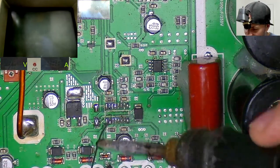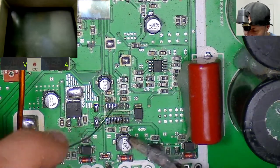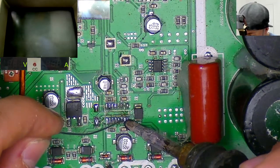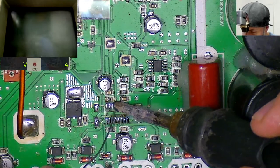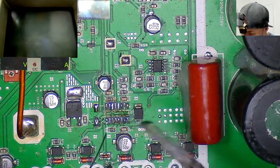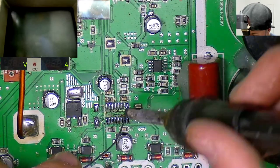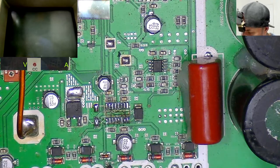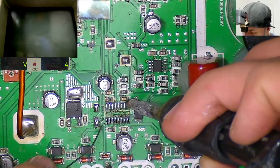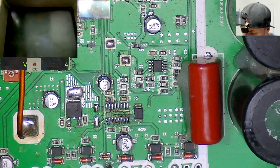But yeah, you would have thought that most amps would fail when being driven hard. Similar with cars, you would have thought, drop the clutch on it and boost it up and that's when the engine gives out. But with amps, with Class D amps especially, it's not the case. They always just tend to die doing nothing. But when you understand how Class D works, it kind of makes sense, because any tiny issue in the drive circuit or any tiny short on the inductor, and basically the whole thing just melts down. Because with Class D, at all times, there is very high voltage, high frequency oscillation going on inside. So if anything interrupts that, it can cause a pretty bad meltdown.